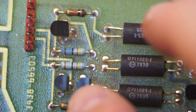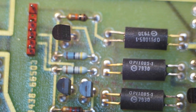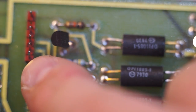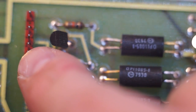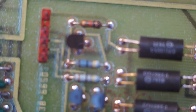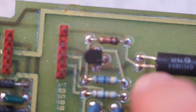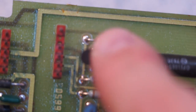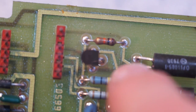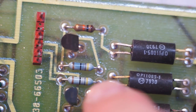So what we have here are just the three inputs from this interface connector. You can see it's got 5 pins. So I would guess, I'm pretty confident this is ground, if I remember correctly. Ground, 5 volts, and then 3 signal channels. And you can see that these all go here. Actually, it looks like, if we look there, there's a pull up and this goes to there. So I would bet that maybe the reason I wasn't seeing the chip select is because it's open collector.